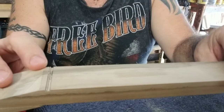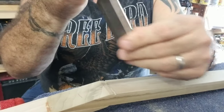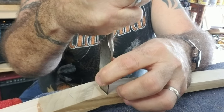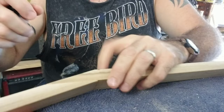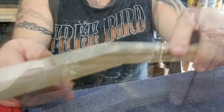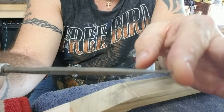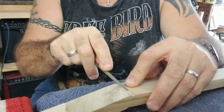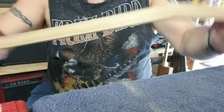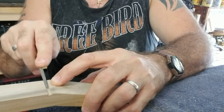You can see that I've cut a few slits there — a chunk already came out of the middle. Then I'll take my chisel and put it in there very carefully and just twist. Then I'll take a little file — a little box file, it's got four sides on it — and just lightly sand that down on this side, flip it around, get the other side, and smooth the bottom out.